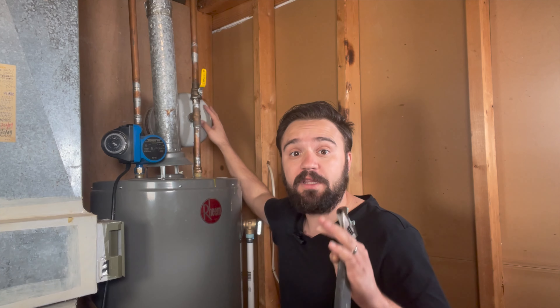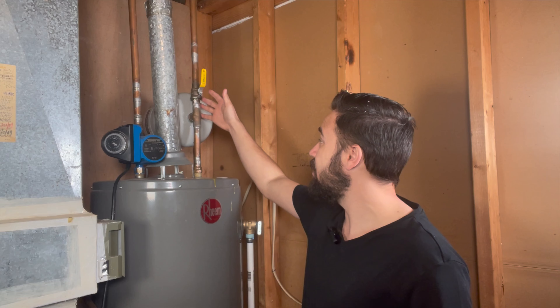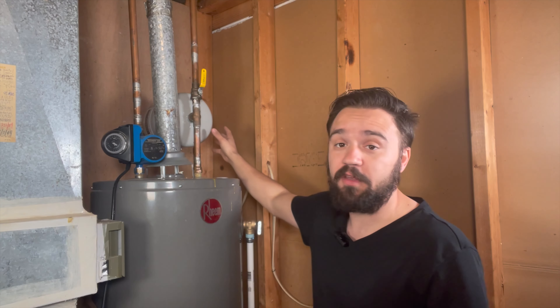One thing for sure is that you should replace the tank with one that's equal in size. In our case, it was a 2.1 gallon tank — you can find it in the description. If you're not sure which one to replace with, check your hot water tank instructions. And lastly, if you don't have one, I highly recommend getting one installed. If you want to tackle that project next, check out the next video on how to install one and make sure it's properly secured.